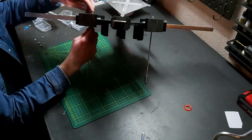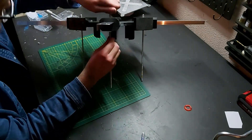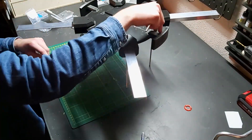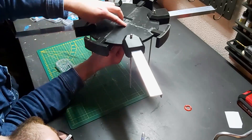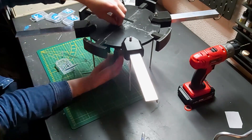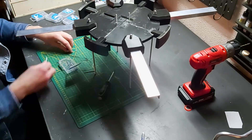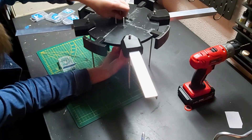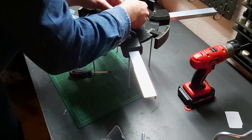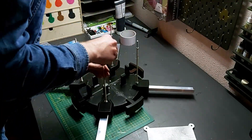But while those first dry, we can finally also add the large threaded rods through the arm connectors. These are then fastened with some bolts. Some smaller M3 bolts are also threaded through the flight controller plate in the middle, as this will be the way to attach both the 4-in-1 ESC and the flight controller. With a little test fit to make sure it works. So with everything working and the plates dry, we can thread those on the opposite end of the rods to start taking the landing gear.